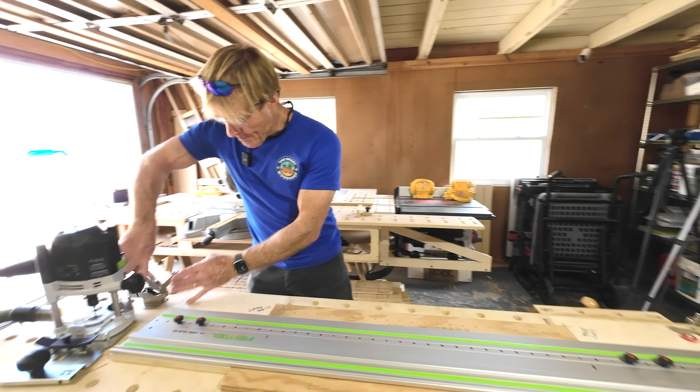So yesterday I came out to the shop and said there just has to be a better way. I made up these plywood brackets and set them up to give me that perfect offset. In the 32-millimeter system, the front row of holes are always — 100% of the time — 37 millimeters off the front. The back holes are different; they're measured as a multiple of 32 off the front holes.